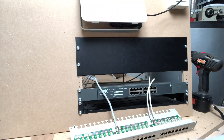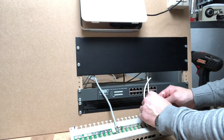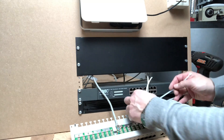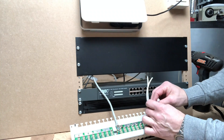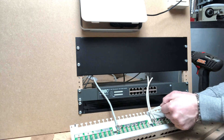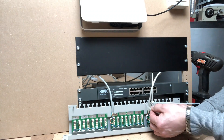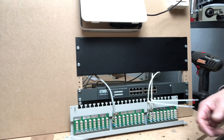The only piece in the installation that needs wiring is the patch panel, and I will show you how to put the cables on the patch panel in this video. Make sure you leave enough cable so that you can take the patch panel out at a later point, because you might want to add an additional cable. It is also best practice to fix the cables with zip ties or cable binders so they are protected against damage — if you take out the patch panel you might rip off a cable and need to redo everything. A good advice is to use colored cable binders.